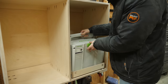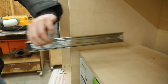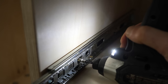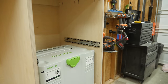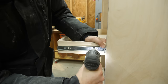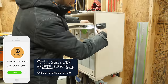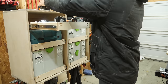I want this bottom drawer to be pretty tall, so I set my track saw in the drawer and place a scrap piece of wood on top to give me ample space for the drawer above. Then I just repeated the exact same steps as before: setting the slide back the correct distance, securing it with screws, reinserting the inner part of the slide, setting the drawer box on spacers, and attaching all the screws. I'll redo that process over and over until all the drawers are positioned exactly where I want them — no measuring needed at all.